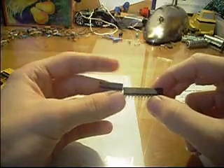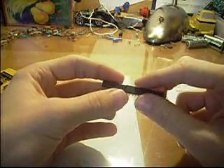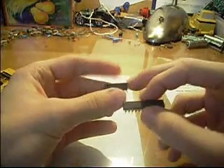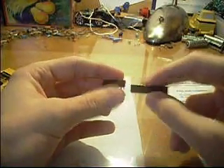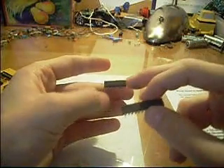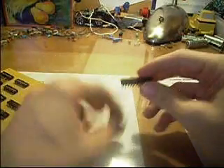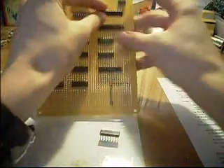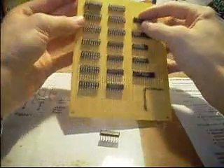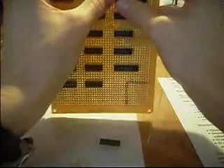I can use it as a jump command or branch-if-equal command. Also, if I plan to upgrade this in the future, this is actually more feasible and more robust than using the 4017, because I can cascade down into another 74HC163E chip and have another 16 addresses. For now, this setup will just count out 10 addresses, with DIP switches to load in new memory addresses for jump or branch commands.